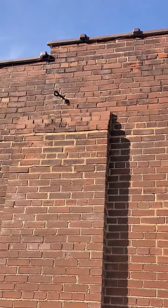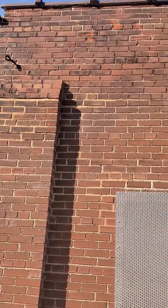This is the corner area that Jorge mentioned, and Amy Harrison — our customer — said water is getting in these windows. The windows could be leaking, or it could be coming through the grill across it. You can also see the crack in the mortar up there, and some different spots if you look carefully at the roof.